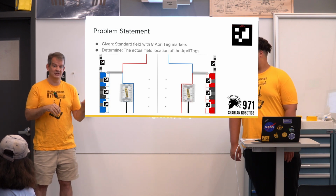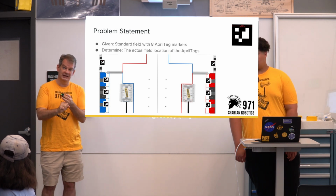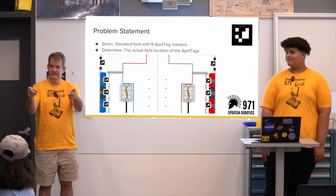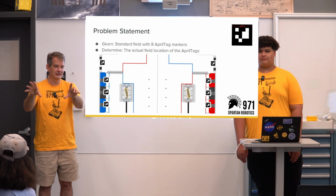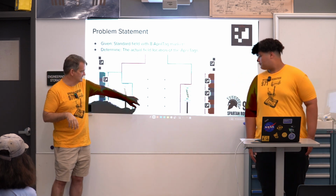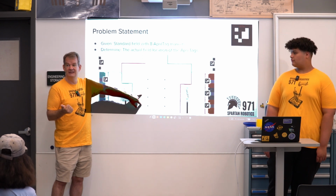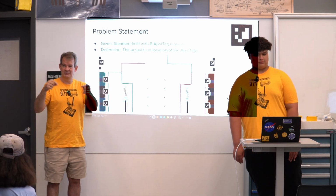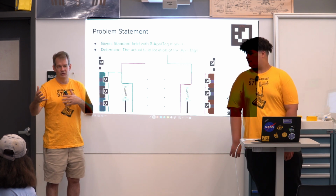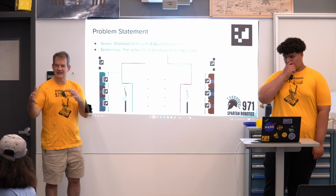We've been talking about doing an online estimator this year that will take that information. You can imagine there are two things that can happen. One is I see two targets in one camera view, and this goes back maybe a little bit to your question. It gives me two estimates. I plot those, and maybe they put me in different locations. That tells me that probably my map is bad, because I've seen two targets by the same camera. That same camera better be in the same place, but the estimates are in different places. So what's wrong there? It's likely that the map is incorrect. So it tells us, hey, you need to go fix the map if that's happening consistently.